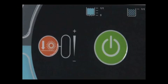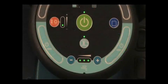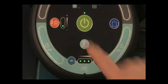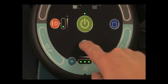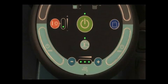Pressing the button again turns off all scrubbing systems. When the one-step button is pressed to stop scrubbing, the machine remembers which scrub settings were active. When the one-step button is pressed to start scrubbing again, the machine will return to those settings. To allow the cleaning solution to remain on the floor and improve your cleaning results, you can raise the rear squeegee and turn off the vacuum fan by pressing the squeegee button. Pressing the squeegee button again will lower the squeegee to the working position and turn on the vacuum fan so you can recover the solution.